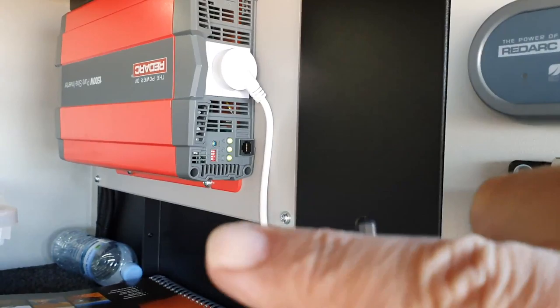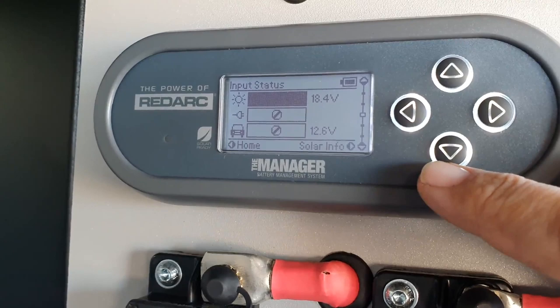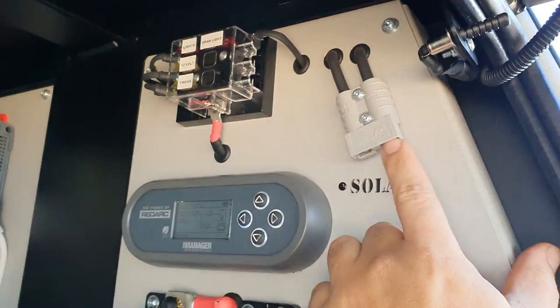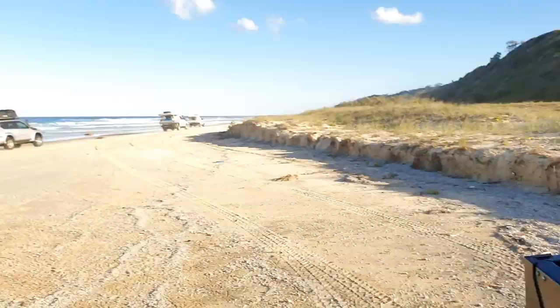You can see it's putting in about 18.4 volts from the sun, still a bit from the car. There's not a whole heap of sun out because it's afternoon, so we're pulling about eight amps and putting bugger all in from the sun. But you can plug in an additional solar panel, and I just keep that extra solar panel here - I just went with the Hardcore.